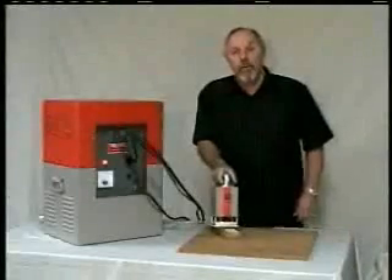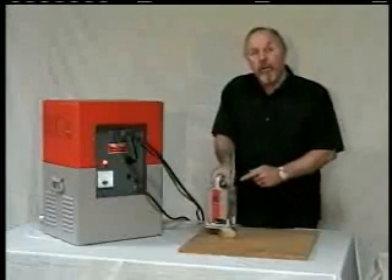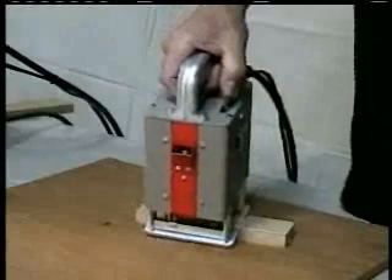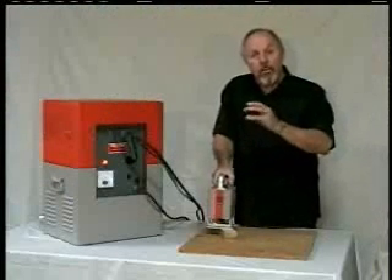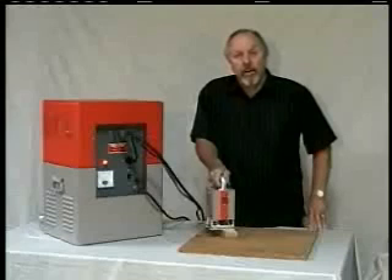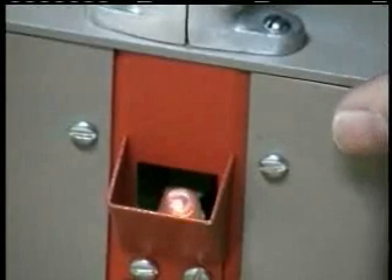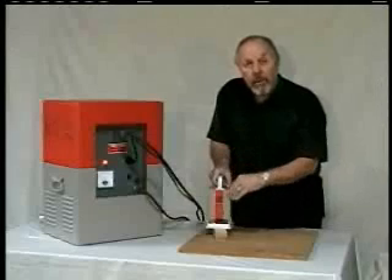When using this machine, realizing that it's a radio frequency machine, it reacts just like a radio. The thumb adjuster will go forward and back to attain high heat — forward is not high, backward is not low. It's more like tuning a radio where you find your station. There are two ways to know if you're achieving high heat: watch the milliamp meter and notice it goes high on the scale, and watch the glow lamp on the face of the handgun — as it gets brighter, it corresponds to the milliamp meter.